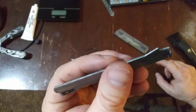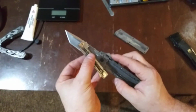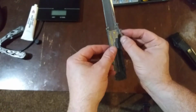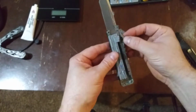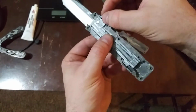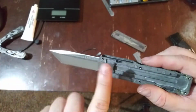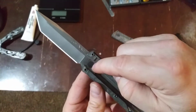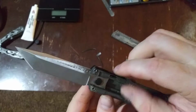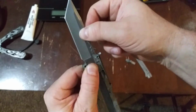But essentially what happens is that button basically is attached to this slide mechanism, right? And you could see the slide mechanism, you could see these locks. Maybe I will show quickly how these locks work. So the knife is fully out, and normally we have a little spring tension. The front hook hooks the front of this wheel, this circular piece here, and that's what pulls it tight against the lock, keeping it from being sloppy.